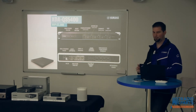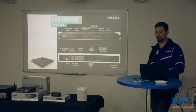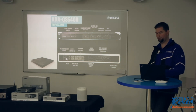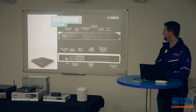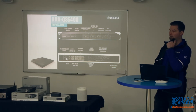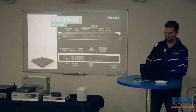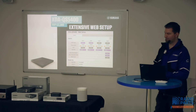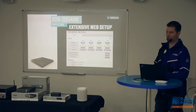You've also got trigger outputs on the back so you can synchronize power with other devices — switchable high or low depending on requirements — based on power to the main zones. Speaker connections use Euroblock terminals throughout. As for the web setup — here's a screenshot — it gives you actual zone control from the General tab including volume, power, source selection, EQ, and speaker processing options for in-ceiling, in-wall, compact, and floor-standing speakers, with features like bass extension and compressed music enhancer.